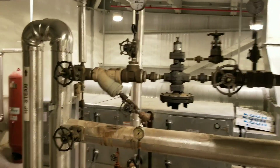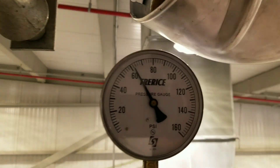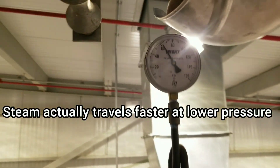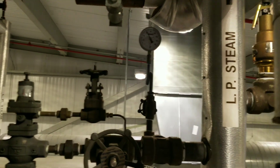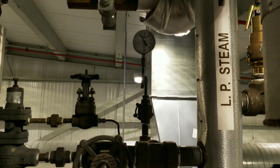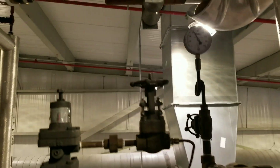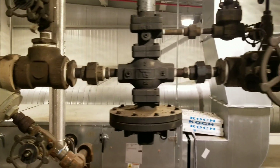That was on a service call, so we're back just to do some regular maintenance and I figured I'd start here and try to see what we could figure out on this steam. We got most all the air vents bled. Take a look at this — that was running 80 earlier. It was set on 60 on my last visit, and now that I've got the air bled from the system, my pressure dropped.